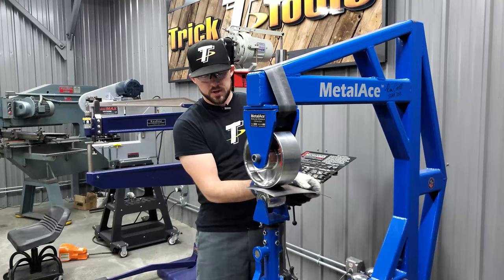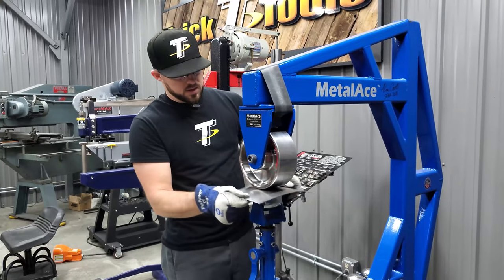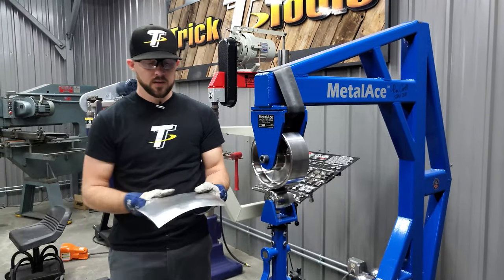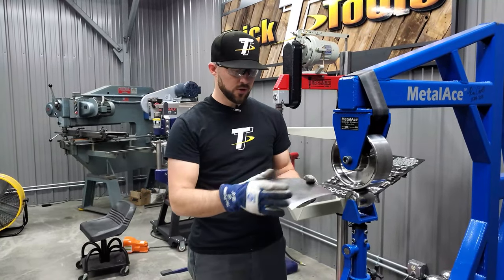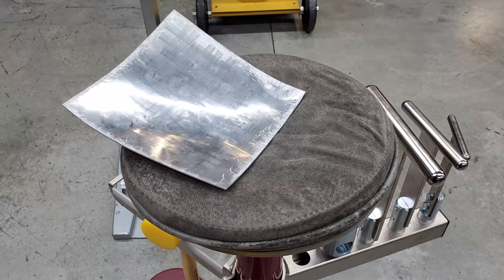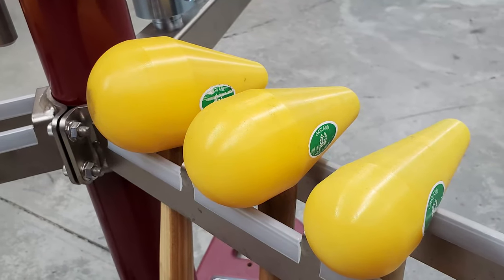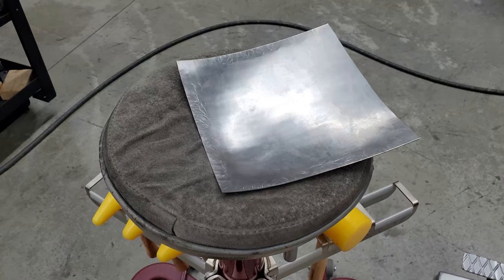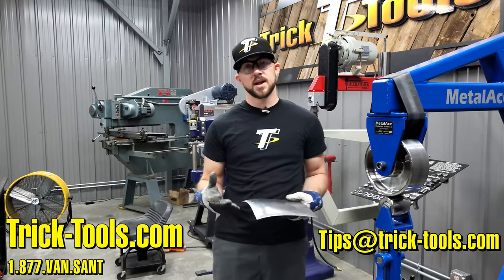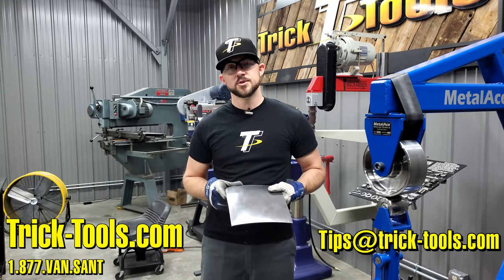With this, you can easily see how using just a couple of basic machines — the English wheel as far as metal shaping goes is about as basic as it gets — it's a lot about technique. But when you use something like a shop bag to get your shape started in a part, you can see how easily and quickly you can start to create some unique compound shapes depending on whatever you're working on. Hopefully this explanation on shop bag usage mixed with a couple of other basic machines helps up your sheet metal shaping game and gets you started on making your own compound shapes in your shop. Thanks for watching this week's Trick Tip Tuesday — we'll see you next week!